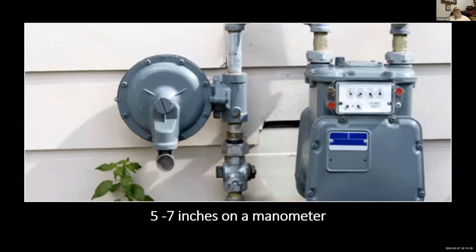Your traditional system, as far as pressure goes, is so low. We measure it with a manometer. So it's maybe up about 7 inches or so of water column. You always see guys on TV in the action movies jerk a gas line out from behind a piece of equipment and it's waving around and spraying gas everywhere. I always point out that that's movie pressure.